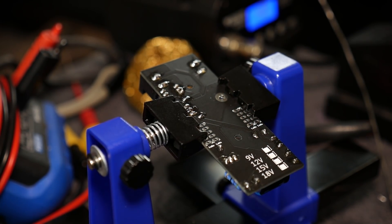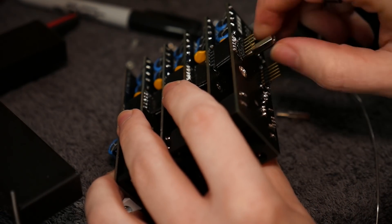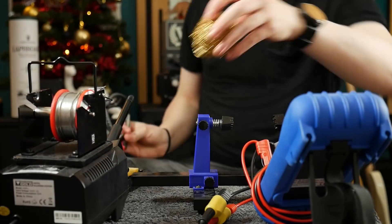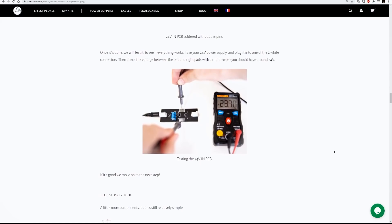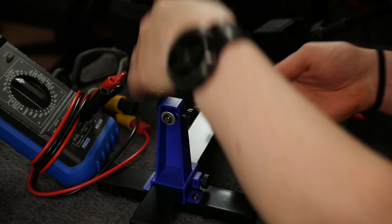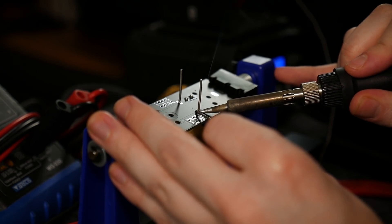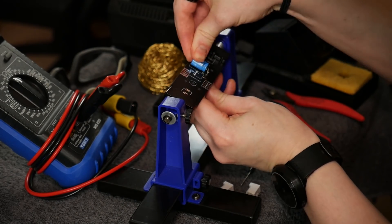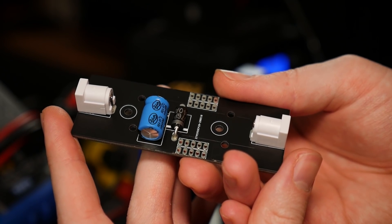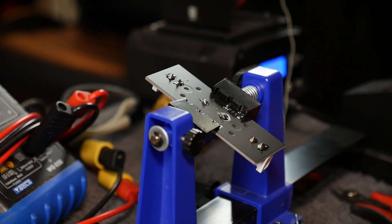There are labels on the supply boards to mark which voltage you've selected, but these become obscured when fully constructed so you may wish to find a more visible means of labelling these to avoid over-voltage accidents later down the line. Just like the EgoDriver we looked at a few months ago, there is comprehensive documentation available for free through Anasounds' website which will take you through each step of the process and show you how to test your work as you go. The 24V inboard is very simple, containing only two components: a diode for polarity protection — this will protect your supply and all your pedals if the wrong power is inserted — and a large capacitor which works both as a filter and a reservoir, ensuring there is always a store of energy in case there's a sudden peak demand on the supply. The 24V throughboard is even simpler; there's just one component, a protection diode should you stupidly use this as a power in rather than a power out.